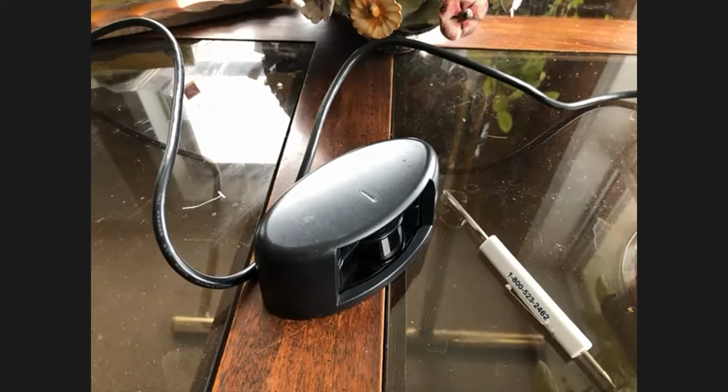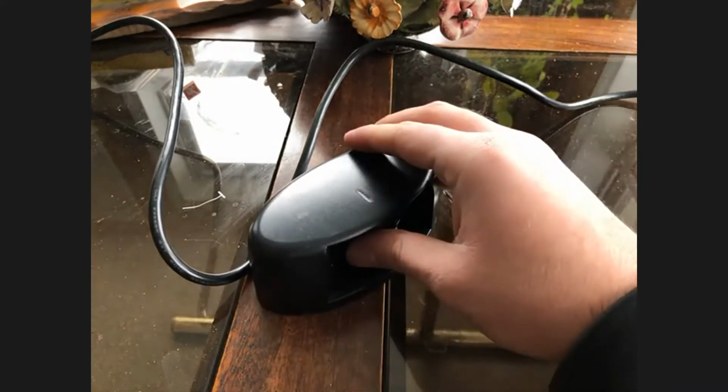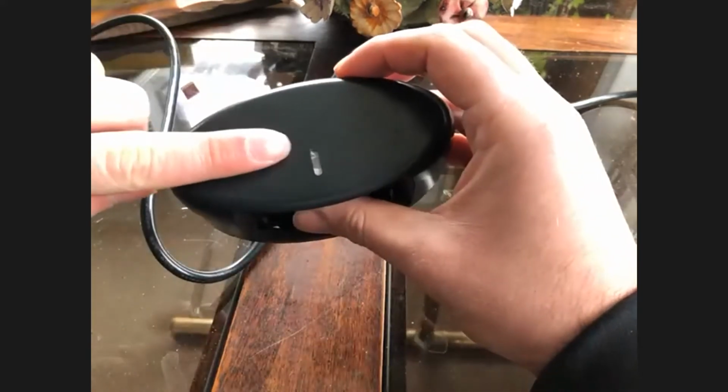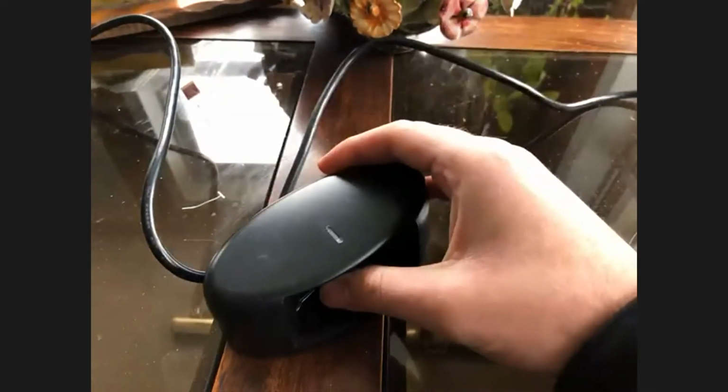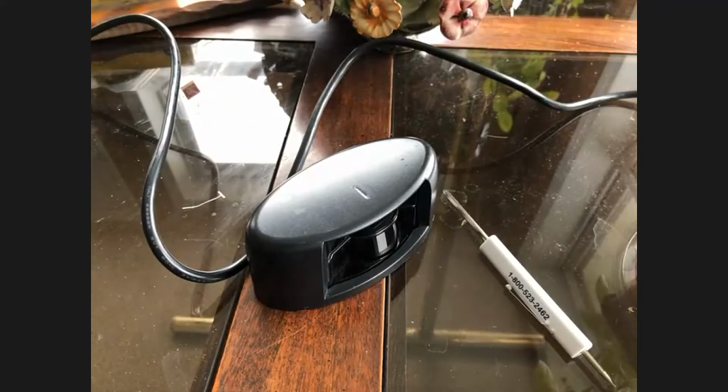Well, yes, there are a few things you can look out for, and that's a great question. The sensors themselves have a blinking amber light if you have an error, but there are several different levels of errors on these. Sometimes you'll notice it's not amber, but it'll blink or be steady red, even though the door is closed and it won't work. So obviously that could be an input. The sensor could have been hit, the harness could have been pulled, or some event could have happened, and it's now twisted out of position.